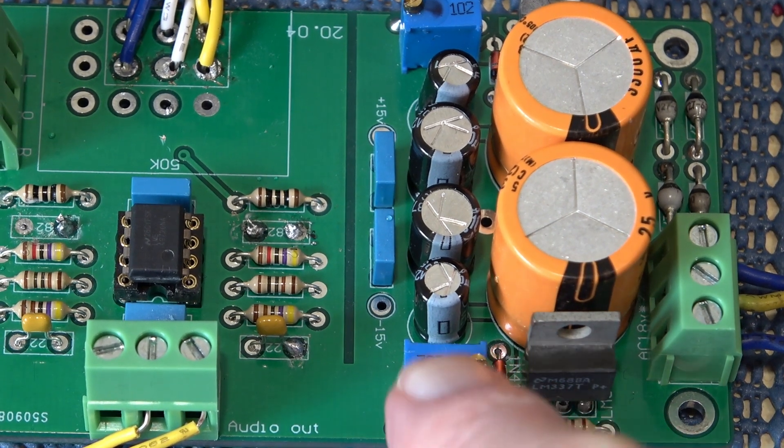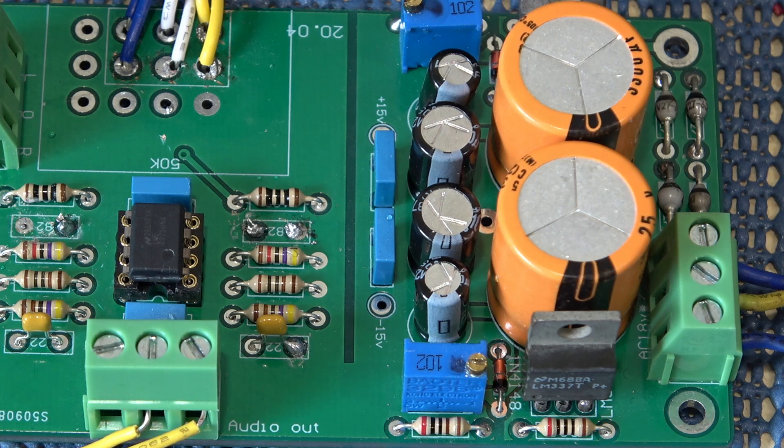As a footnote regarding the pots: don't be tempted to crank the voltage up beyond 15 volts. That is the sweet spot for most of these integrated circuits. You could squeeze a little more out — perhaps 16V — but the absolute maximum is about 17V. Why would you do that? It will theoretically increase headroom slightly, but the headroom on this is way more than you'd ever need. Play safe — it's not worth the risk for no real benefit.